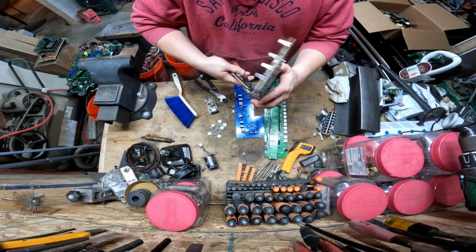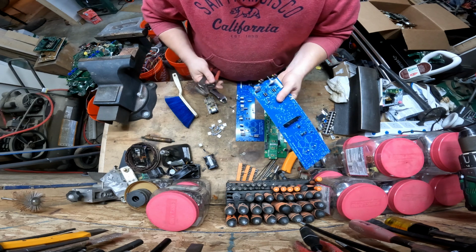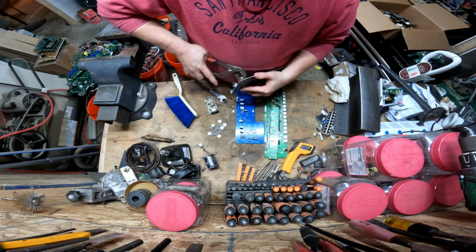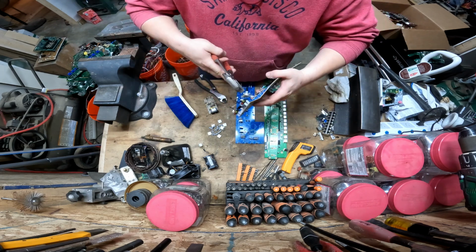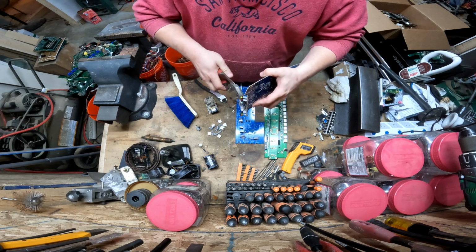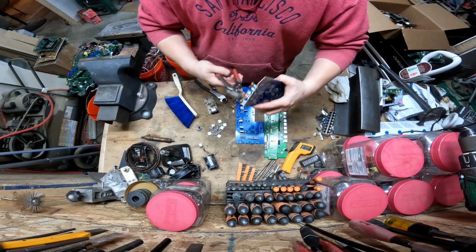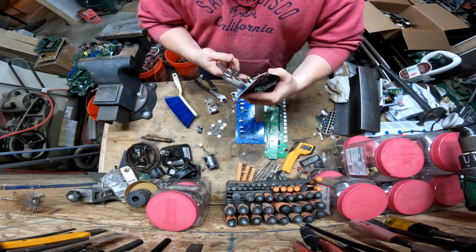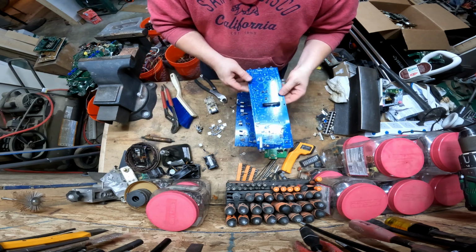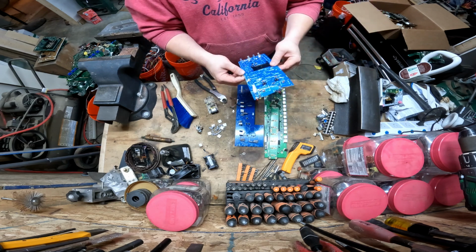The big thing I want to avoid is sending steel through it, because the steel won't be crushed or pulverized. It may just make a bunch of noise in the machine instead of actually being made smaller, and that'll do me no good. So if I can get it off here, it saves me the trouble of going through the machine. And then I'm just sorting them into 2 grades. This will be a low grade board because there's nothing on it of real consequence.